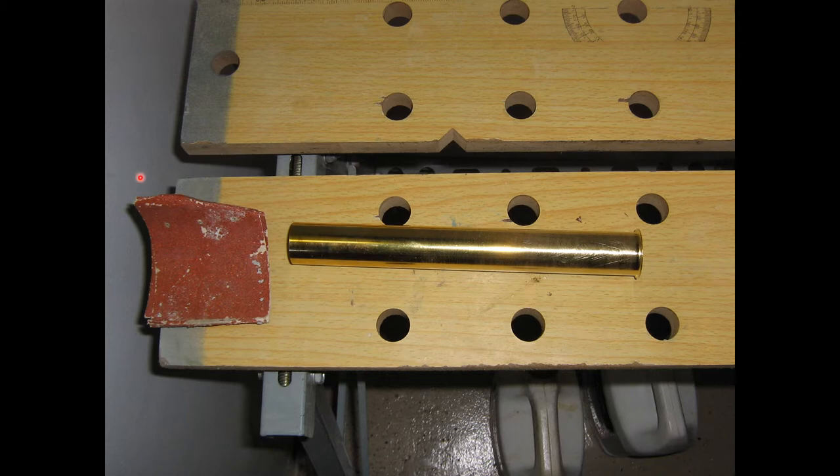This is an extra long 1-inch brass drain tube that I ordered from Fisheries Supply. Here I am scuffing it with 100-grit sandpaper to give the epoxy a better mechanical bond to the outside of the tube. You can install it with 3M 5200 sealant — I'm just choosing to use epoxy. There's also a tool to make a flange on both ends, but I typically don't do that. I just install them with sealant or, better yet, epoxy.